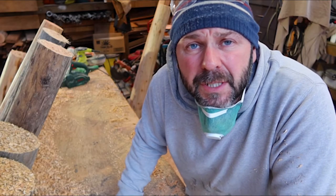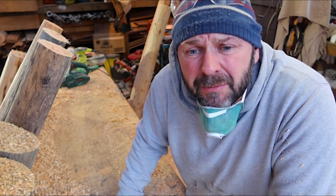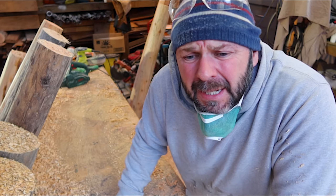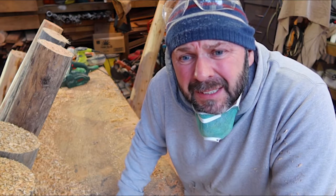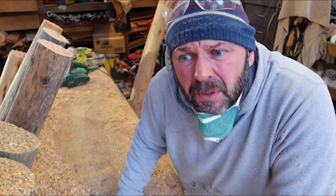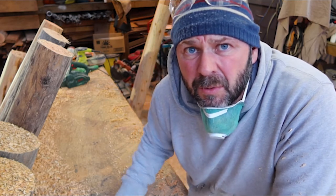I've done a few of these posts already. I'll crack on with a few more and just show you what I'm doing — really just planing them and then sanding them, then filling with some epoxy black filler to make it look nice, then varnish it all up. I'll grab another one and show you what we're doing.